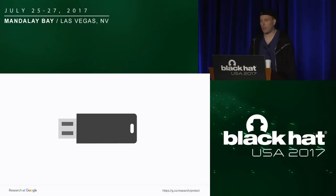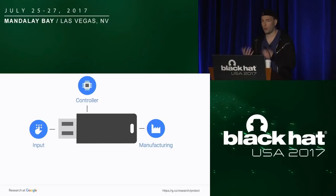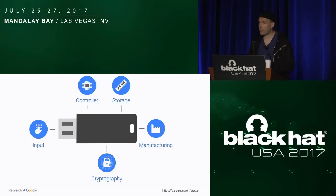So what do we want to cover during this audit? There are five categories we believe encompass most of the attacks you can carry out. Those five are: secure manufacturing — how you manufacture your key to make it resilient to attack; input security — making sure the input part of the key is actually safe; controller security — you don't want the controller to spill your secrets; cryptographic operations — making sure you use correct crypto; and storage verification — making sure data is really encrypted on the storage chip itself.